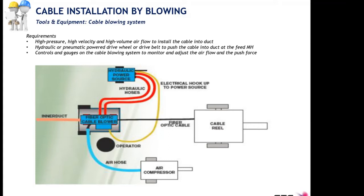We are going to see some videos that illustrate how these machines operate together. Remember that when the ambient temperature is higher than 25 degrees centigrade, we install an after cooler between the air compressor and the blowing machine to make sure that the air insufflated inside is cooling off and not harming or jeopardizing the installation.